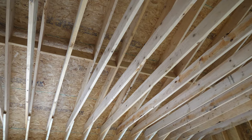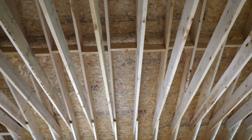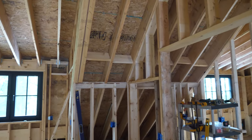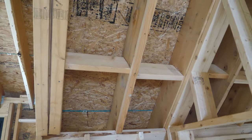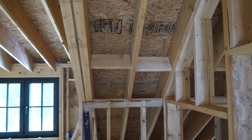I'm just going to pocket-screw all the blocking in — I like that connection better than end-nailing with a framing nailer. If you look closely, you can see we did the same thing on the roof rafters up there — just staggered to make that happen — and that really stiffened up the roof diaphragm. Same thing on these long-span joists. The key here was we used 2x10 rafters but only 2x8 blocking, which kept the gap above the blocking so we can have a ventilated roof deck.